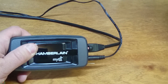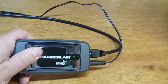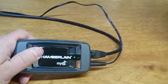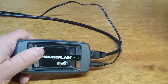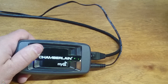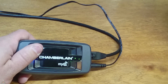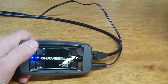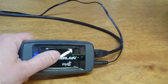In my case, I initially did not have a green blinking light — there was nothing there. I was plugging and unplugging it trying to figure out what was going on, because the instructions say when the green light is solid, you're ready to proceed. Through troubleshooting, I ultimately discovered that not all internet routers work with this Chamberlain gateway. When I plugged the unit into port number 3 on my router, I finally started getting the green light, and it became solid, meaning it's connected.